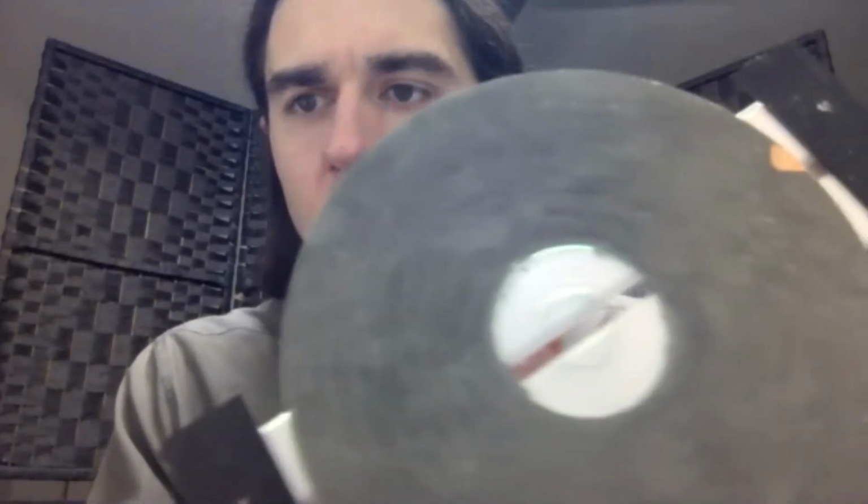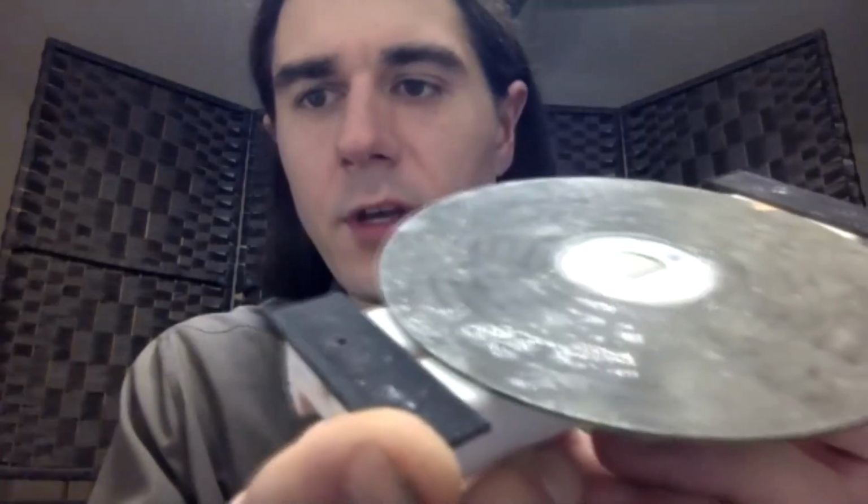And so it's not perfect. It's not a perfectly smooth surface, and it really shouldn't be. In fact, the idea is that all the charges will get trapped on every little conducting metal particle within here, and because they're epoxy insulated from each other, the charges shouldn't be able to leak off. This was placed behind a piece of 50 kV dielectric and pressed directly against it. This just sort of keeps the charges from flying from the dot product disc over to the cross product disc.